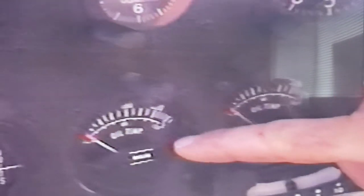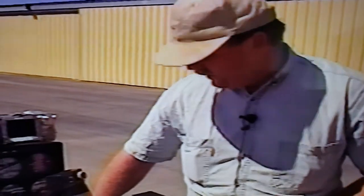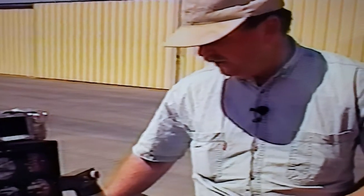Engine oil pressure must stay in the green. We have two oil temperatures: engine oil, which I don't like to see over about 190–195, and the main transmission temperature, which gets hotter as you put more power into it. On a very hot day, ambient air temperature could push it over the limit, but that's never happened — normally it runs around 120 degrees in flight, which is very acceptable. I also monitor the alternator via amperage and voltage. There's a COM radio and an encoding altimeter for controlled airspace, though I rarely use them.